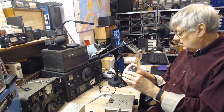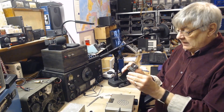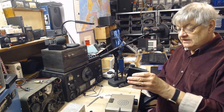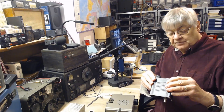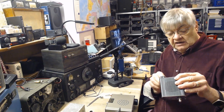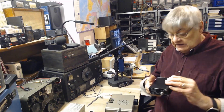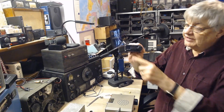On the back, you've got batteries in it, a charging lead, the telescopic aerial, a BNC socket for the aerial, and a headphone socket. FM is good on this as well. On/off switch on the back. Then on the front, you've got band up and down so you can switch from band to band, volume, step for frequency steps, AGC mode — upper sideband, lower sideband, AM, FM — bandwidth so you can narrow it down on shortwave, which is useful. And that is the tuning, which changes on the little screen there.